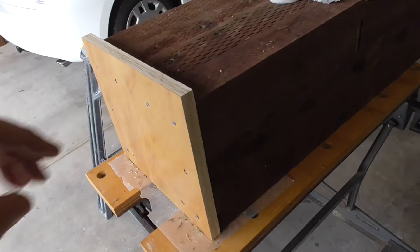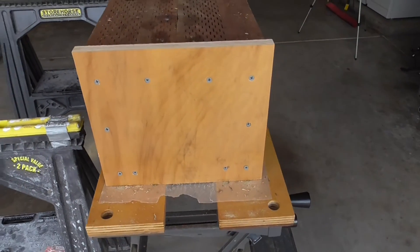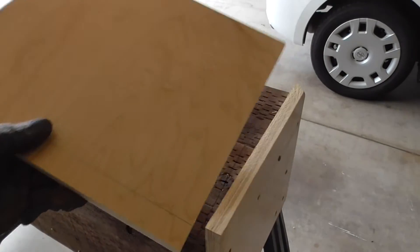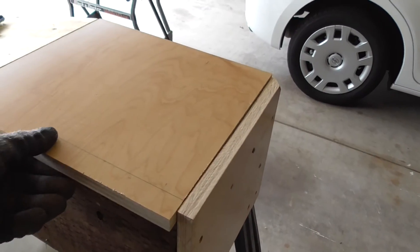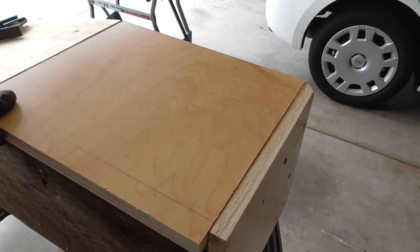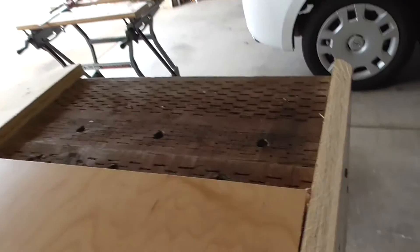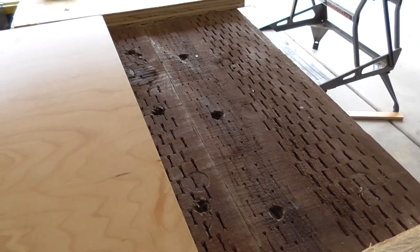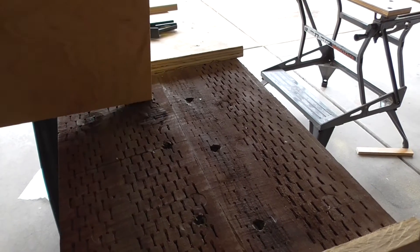There it is — the gap is filled. Just glued and screwed. Now we come to the last piece — should be this piece here, another spare piece of plywood I've had laying around for ages. I'll use it to fill in the gap here. I've already cut it to length — it's about right. Close enough is good enough. It does rock in the middle a bit though, so there is a slight misalignment of the wood right along there. I'll just take that down a little to make it smooth, then glue and screw this one on, avoiding the screws in the middle.